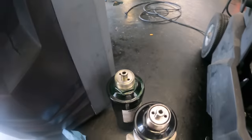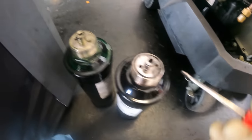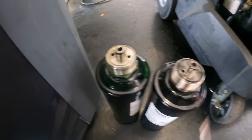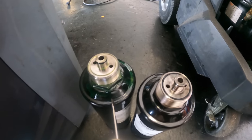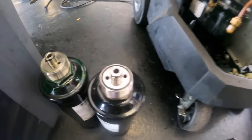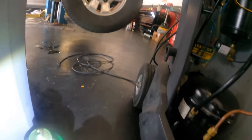I think I might have just saved us a service call. Look at what I found right here — comparing the top sections and noticing all this dye. I see that this receiver dryer filter assembly does not have an O-ring on top, whereas the new replacement one does have an O-ring. And looking up into the manifold, that O-ring is not present in there — it's not there. So this thing has been leaking all over the place for quite some time.